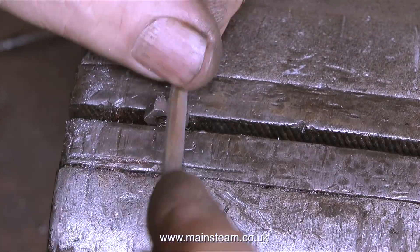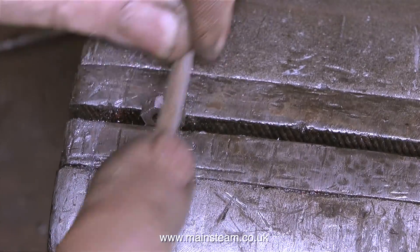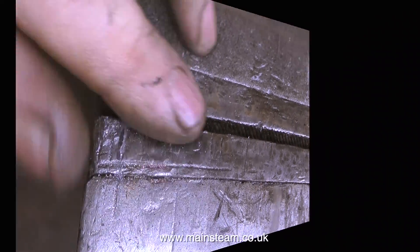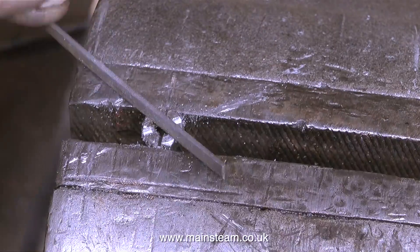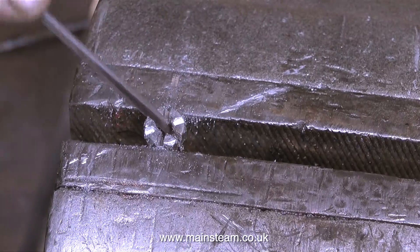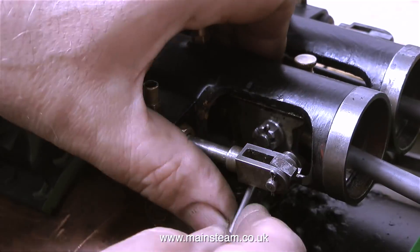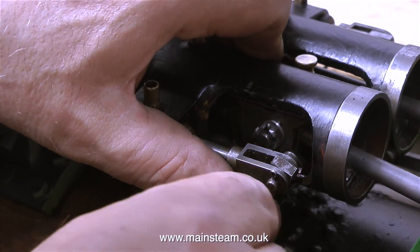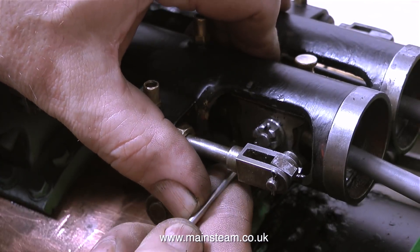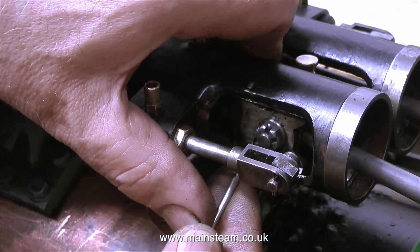What I'm going to do is file up these castellated nuts, which are handmade and not very good really, but they'll be okay once I've re-profiled them with a needle file. Normally when holding things in a vise I would use a couple of pieces of brass angle to stop the teeth on the jaws from marking the work, but for this job I was holding the castellated nut so lightly I didn't need to do that. In no time at all I re-profiled the slots so it looks like a proper castellated nut. This time when I fit it to the gudgeon pin with the washer in place, the split pin goes all the way through and I can bend the legs out at the bottom — this will stop the nut from ever unwinding from the gudgeon pin.